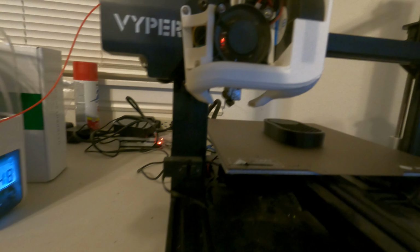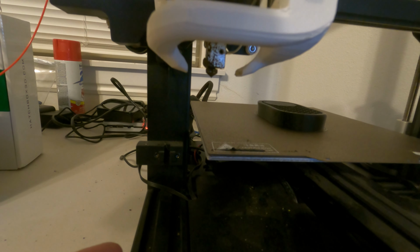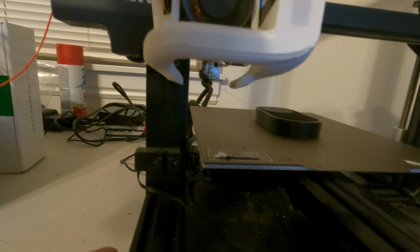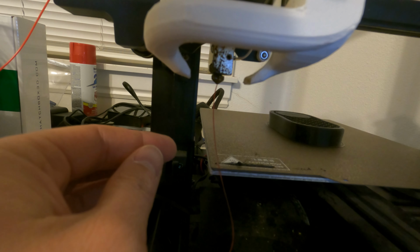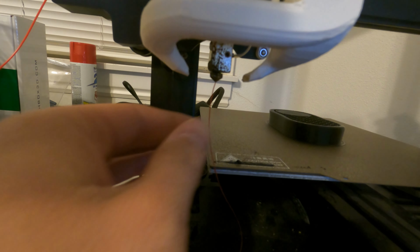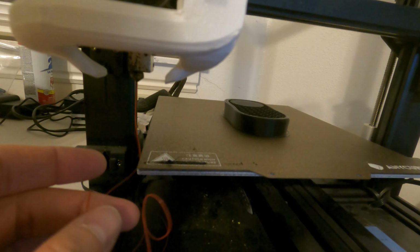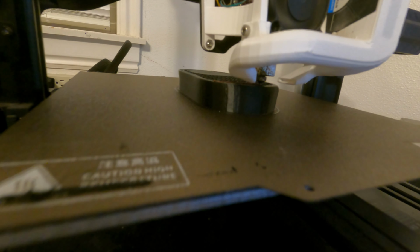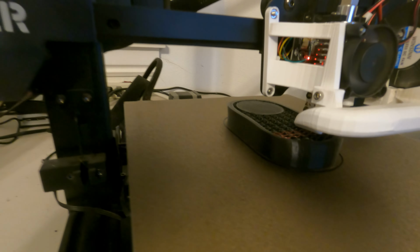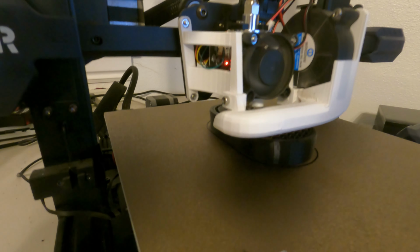You see it lifted up about 50 millimeters. Take that off. It lifted up about 50 millimeters after it retracted the filament, just like we told it to. And any second now, goo's going to start coming out. It's going to transition to red. It's going to purge all the black. Now it's red. So I'm just going to catch that, because as soon as it's done purging, print head's going to move back over to our model, and it's going to go down right there. I'll go ahead and pluck this out, and now it's going to start printing in red. So it's printing in red on top of the black. And we'll be back to this point again when we're ready to make the next transition color.